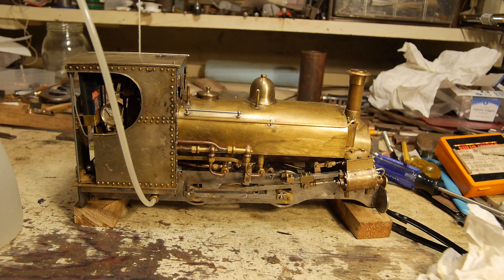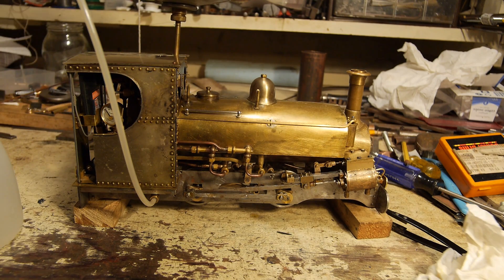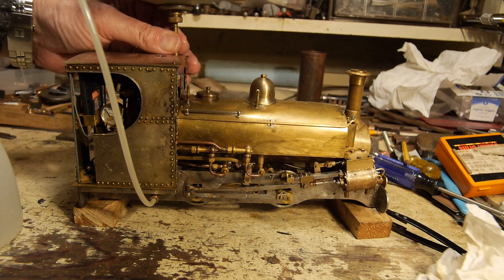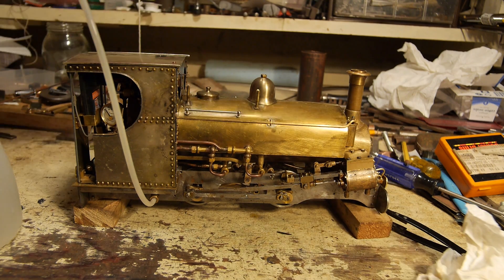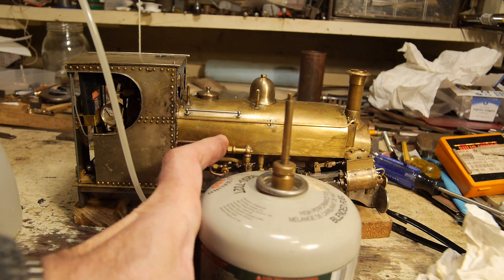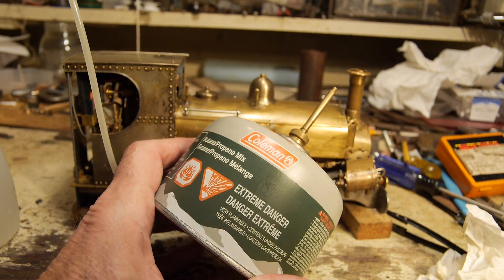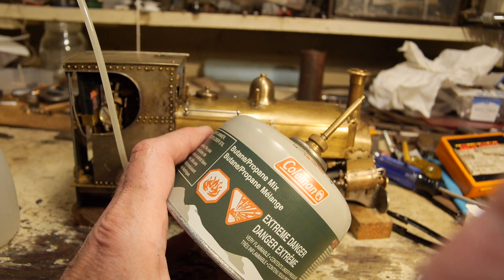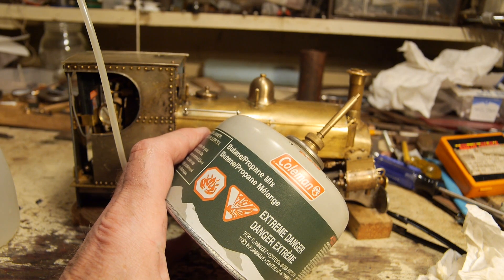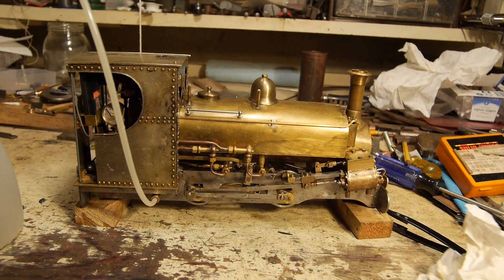Next is filling it with gas. I made a hole in the top so that I can connect down into the gas tank through the Ronson valve. It's just a normal mixture of butane-propane mix. People say you shouldn't use this — pure butane is pretty difficult to get hold of and also quite expensive, so I tend to go with this stuff. It works fine as far as I'm concerned. Something to do with the pressure in the gas reservoir tends to be a bit higher, but I test my gas reservoirs up to about three or four hundred PSI, so I have no fear of it exploding. Do check with your engine manufacturer before using this mixture.